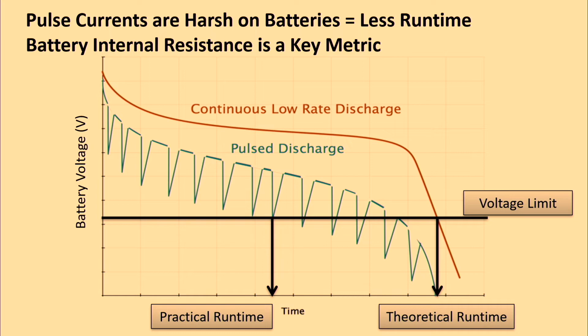And so with a lot of our customers, when they were testing other types of batteries, other competitor batteries, they were basically getting negligible runtime, and it was not meaningful for their products. So we thought this was really strange because the metric of success here is really internal resistance. But our customers really had little to no intuition about battery internal resistance. And now that I think about it, it makes a lot of sense. Oftentimes battery data sheets don't even list internal resistance as a metric on the list. And so, it's not something that we typically interact with or communicate.